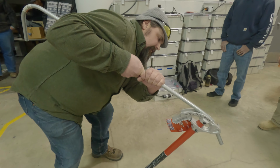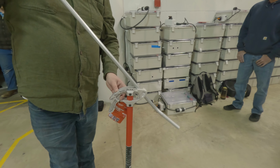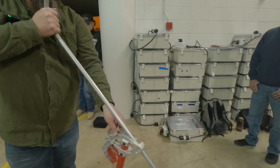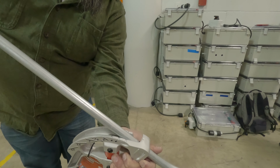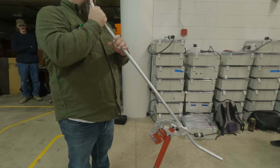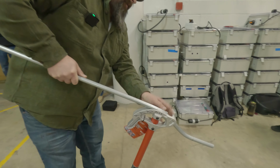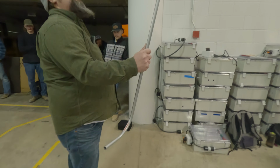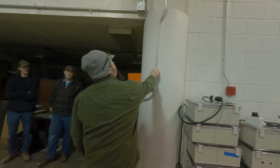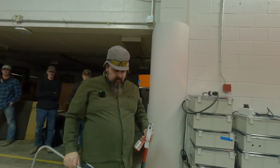Like I said, on the box offsets, sometimes you don't need to go past it. You can get kind of close, and you can take a little bit out of it. What I usually do is I send it down like that. This is going to be dog because we didn't measure our 90, right? But bring it back up to our start point. Check again. Sometimes you can kind of feel if you're going a little bit too far. If that 90 wasn't on there, it'd probably look a little bit better, but kind of a simple offset there.